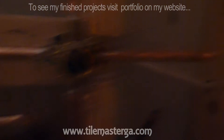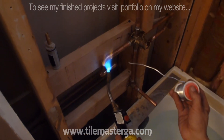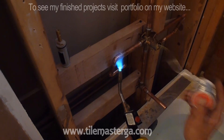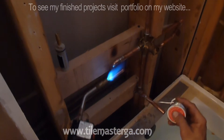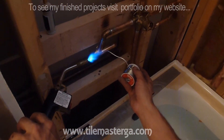The hot side is ready to be soldered, and I'm going to work on the cold now. I'm not going to show all the soldering — you already have an idea how to do it from some of my other videos where you can see how it's done in detail. The only difference between the shower valve installation and the tub valve is the faucet at different locations; the rest is pretty much the same — same valves, same components.